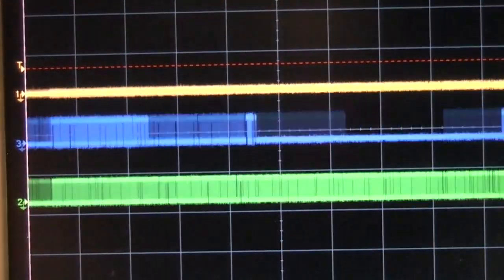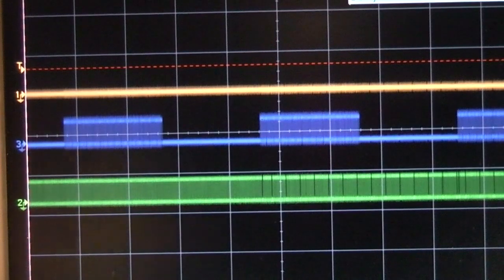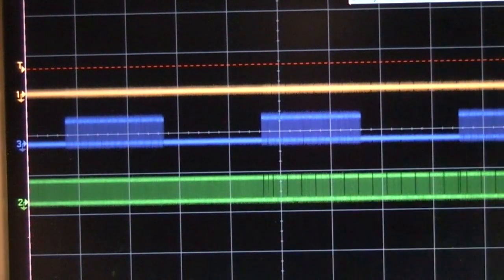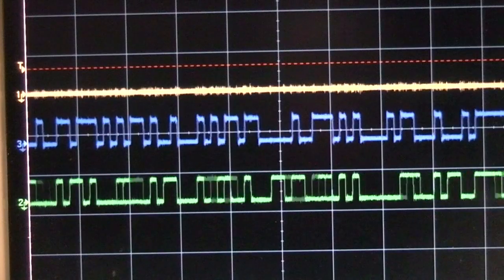And then we've got what looks almost certainly like image data. We've got some noise floating around. One thing I did notice is that some of this doesn't change when you wave your hand over it, and some does. So I'm guessing there's maybe some reference data, some covered pixels providing reference data. If I wave this soldering iron in front of it, we see a very rapid change of that. It's clearly image data.